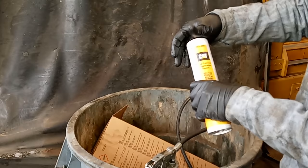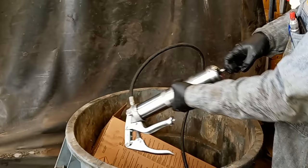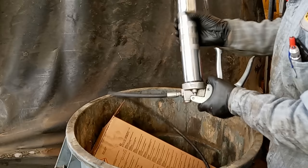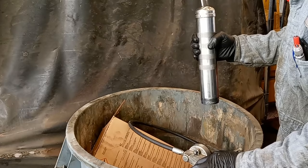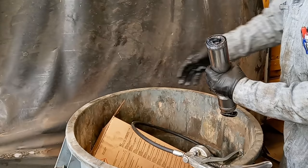I'm doing a real grease cartridge change here. The first thing you need to do is unscrew it — probably about one full turn, maybe one and a half turns — until the point that the plunger rod is able to move. Once it's able to move, you fully extract it and then lock it to the side. Then you can unthread the grease tube holder from the grease gun. The best place to do this is typically over a trash can, because you're going to be disposing of this. Then all you do is reinsert the plunger rod and it'll push your old grease cartridge out. You can see there's still some grease in there, because we did not wait till it was fully empty.